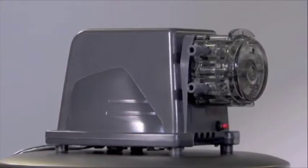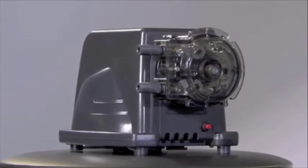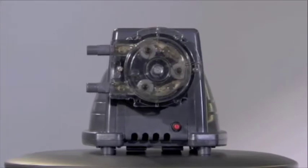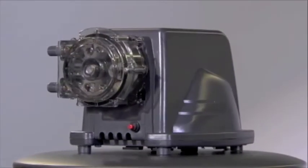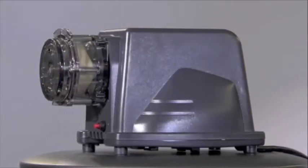Often, the pump is used to inject liquid enzymes that biodegrade suntan and body oils in commercial pools, or to inject liquid grease-eating bacteria to emulsify grease in commercial kitchens. The BDF can also be used to inject biocides on a timed basis into water fountains and small cooling towers.